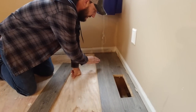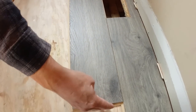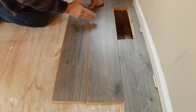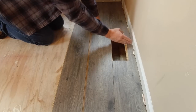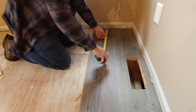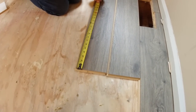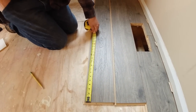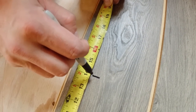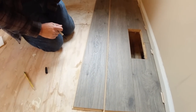When you do your starter pieces, you want to make sure that you stagger your seams. What I mean by that is this is one seam — the piece is this long — and then the next piece I put down overlaps that, and that seam is going to be right here. When you put in another piece, I try to stay away from just going every other because then these seams are going to line up. You basically want the pattern to look random. So I want my seam to be about here — I'll cut a piece at 14 inches. A Sharpie shows up a lot better on this stuff. The only thing you want to be careful of is sometimes when you make this mark and you cut it and put it in, you can still see the mark. Pencil's a lot easier to clean off than Sharpie, but this one should be fine because it'll be down here under the baseboard.